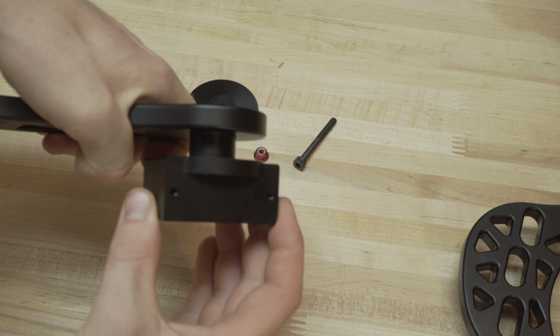Okay, so the next thing we're going to take a look at is just the knobs, how it attaches to the main body of the frame. See that little indentation? The rubber washer is just going to set right in there. Just like so. And this is going to go on this side of the frame here. So how this goes is you take your knob and you're going to have them all face up, and you're going to put it in this hole right here, this outside hole.